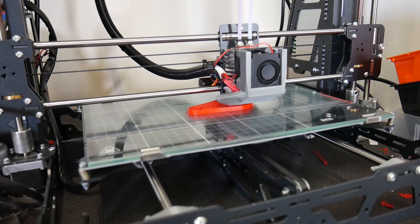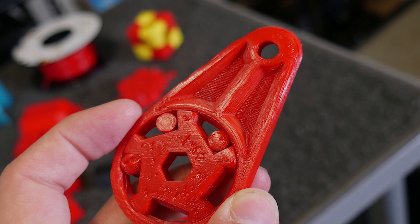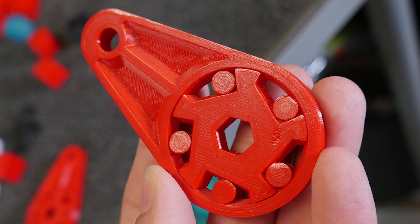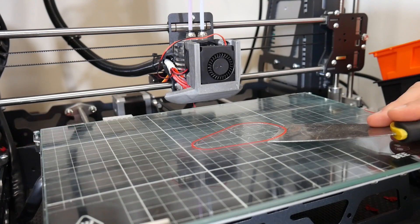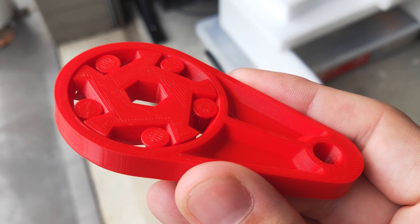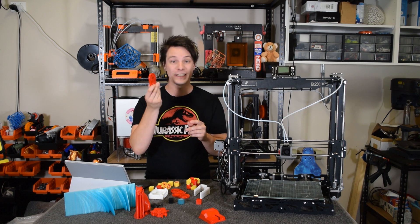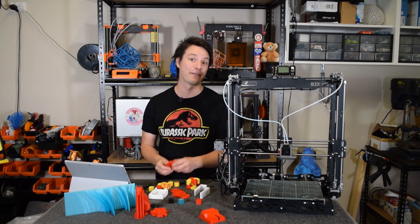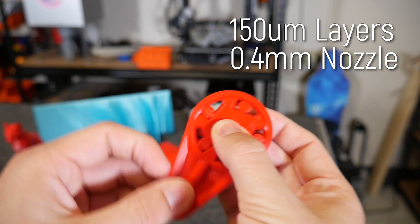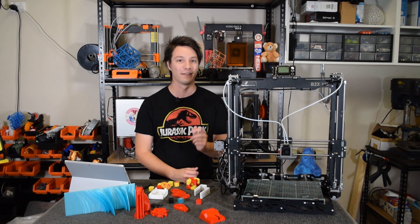You do need to be very careful not to apply too much oil like I did, because it gets into the filament and it stops adhering to the print bed. But after a while, we went from bad results to this. This one-way bearing is an all-in-one design with tons of retractions and small movements, and just look at it — it's probably the cleanest FDM print I've done so far this year. It was printed at 150 micron layer heights with a 0.4mm nozzle in the red PLA provided. I went from being mega frustrated to absolutely blown away, all because of one tiny detail: using an oiler.